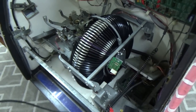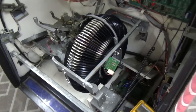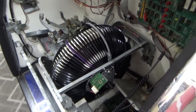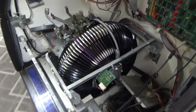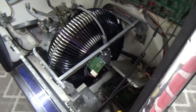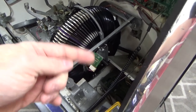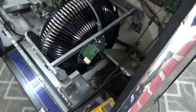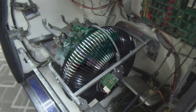Unfortunately, we don't have schematics for this one — I can't find them. I'm going to look on the side and figure out how it's supposed to determine the zero position. Usually there's a home switch that it hits, but on this particular one I can't see one. I haven't found that yet, so I was thinking it was just doing it by counting with the optic on the side. Let me see what I can figure out and I'll come back.